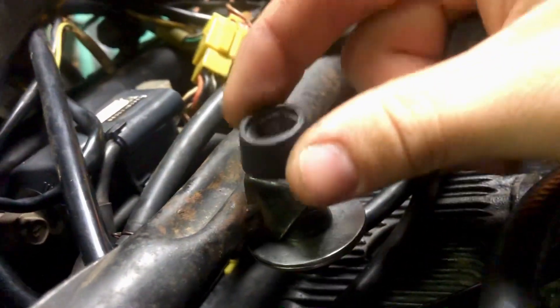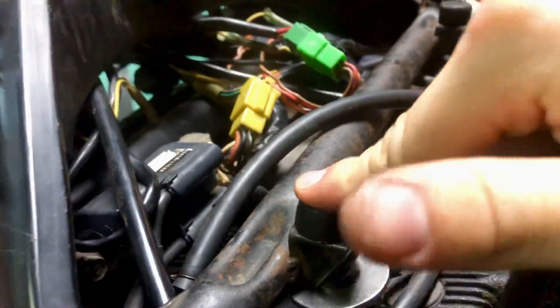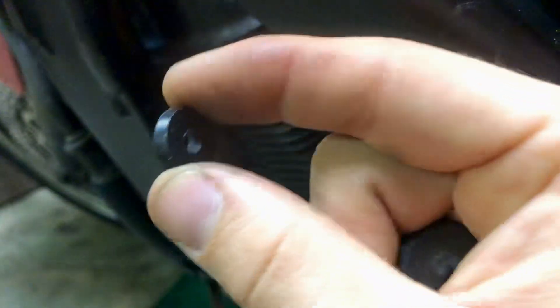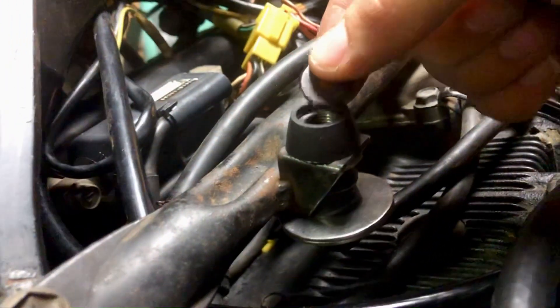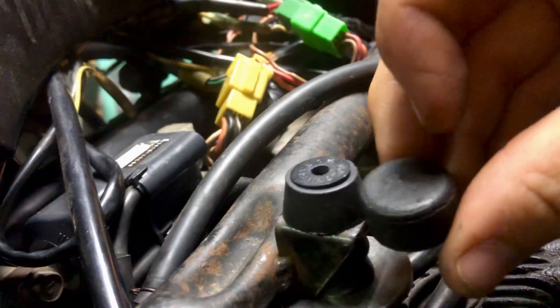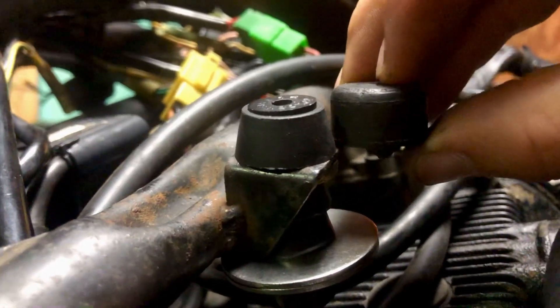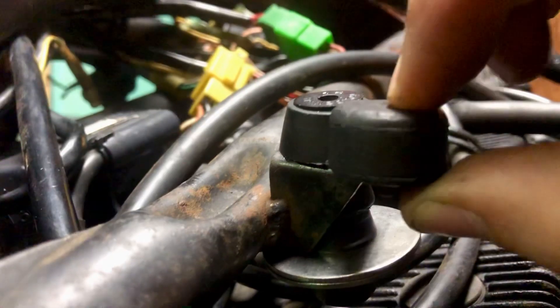What I have right here is a nut up here, and it's tight. Then I have this type of spacer where it's got a bigger end and smaller top, so I put that on there and it fits like a snug glove. You have this, and you're like, well, it's not flat because it's going to squish and hit the metal. So what I end up doing is getting a washer like this, just snug it in right there, and it's the same height as this one over here — pretty dang close. Pretty close in height; I can't get it exactly, but it's pretty dead on.